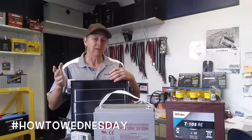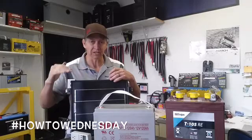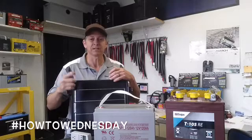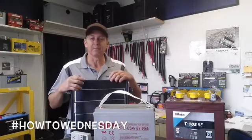If you have multiple devices, you're going to do the math and calculate all those watt hours and get a summary total. But for this example, to keep it simple: 65 watts times 10 hours equals 650 watt hours.